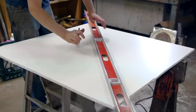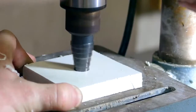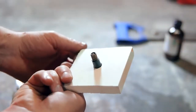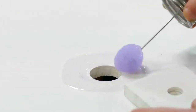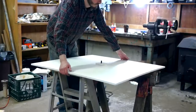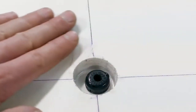For this project to work, I need an air injection port in the center of my square plate. The first step for that is to mount a bicycle tire valve into a small scrap left over from what I trimmed off. I then drill quite a large hole into the center of my base plate. With some PVC cement, the scrap with the tire valve is attached with the valve stem facing outward. Once I flip over the plate, you can see why I've done things this way - the valve is sunk below the surface, and I won't have to worry about it getting in the way.